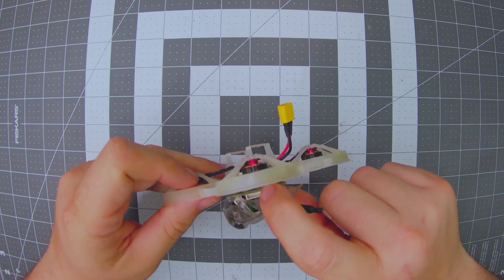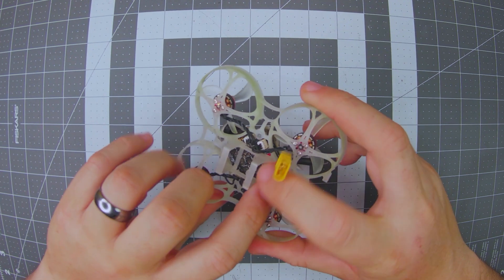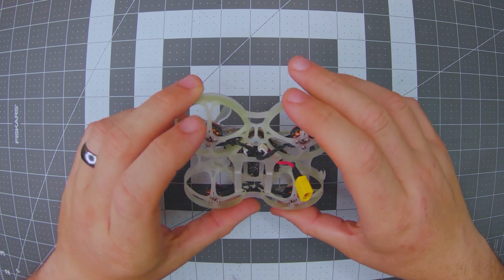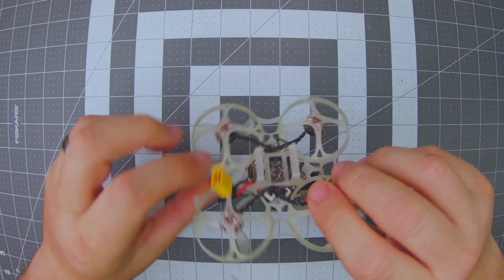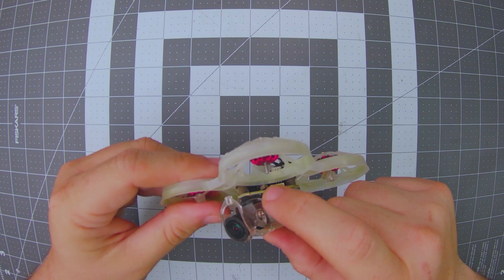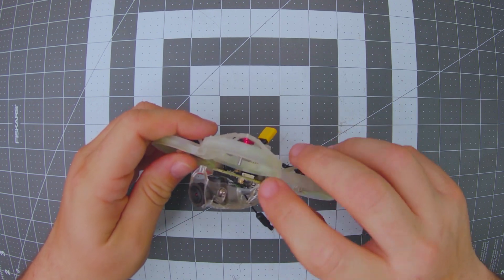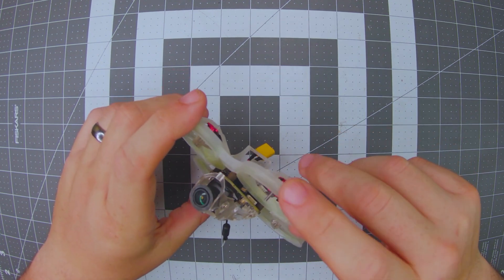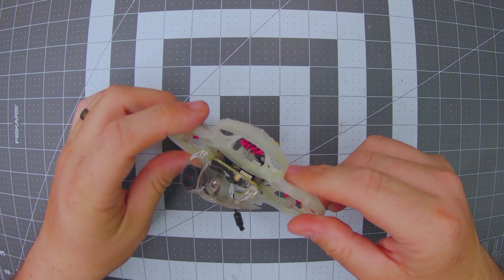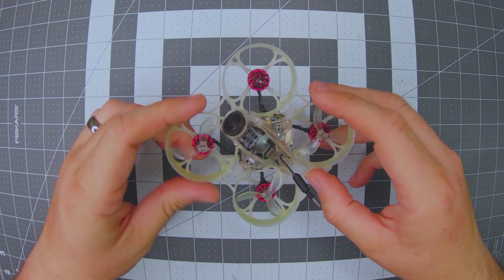Under the Whoop VTX we have the Happy Model all-in-one flight controller with motor plugs, a USB-C for programming, and an XT30 for 2S or 3S batteries. Tucked away is the ExpressLRS ceramic square antenna. This has an SPI ExpressLRS receiver built in, flashed as part of Betaflight with ExpressLRS 2.0 already. So if you're using any version starting with a 2 on your TX, this RX will bind up just fine, and I was able to get telemetry and all the good stuff out of it.